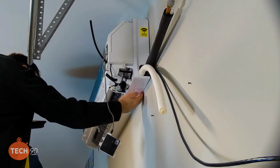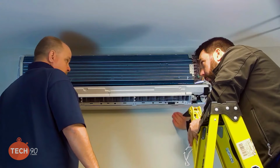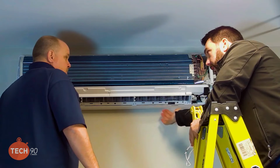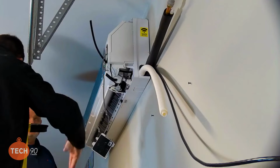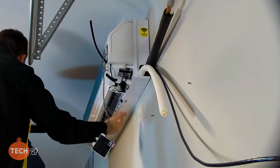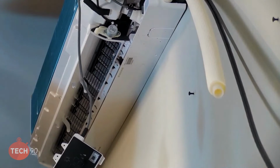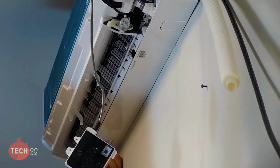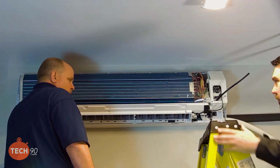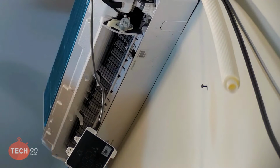That's the important piece of making sure that the bottom of the bracket is mounted well to the wall, even if it's just with the drywall fastener. Right. Because otherwise, this here won't be flush. Especially from the ground, looking up at it, if it's higher than eye level, you're going to see that gap and it doesn't look so great. And the worst thing in the world is putting silicone around it. It just looks terrible.